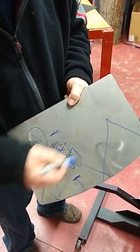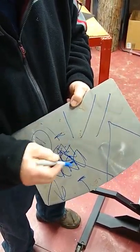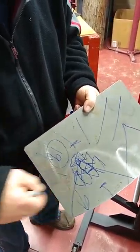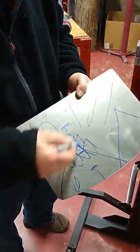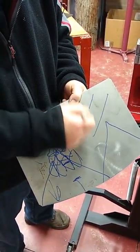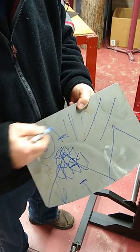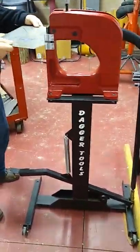Keep in mind that whenever you do mechanical shrinking or stretching, you're pulling metal from other zones of the panel. If I have shape already in one part of the panel and I start doing edge work, I'm going to pull shape out of the adjoining area. People have said you can shrink up a panel to create shape, but generally when you shrink an edge area, it causes the edge to pull over while the surrounding area stays fairly flat — it may even dish in. Keep that in mind.